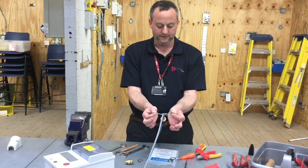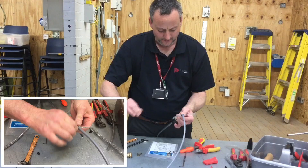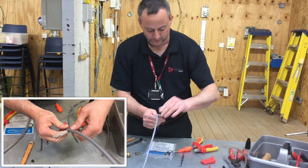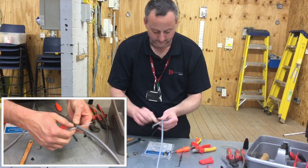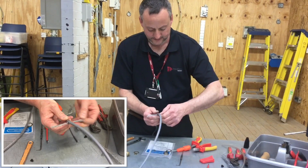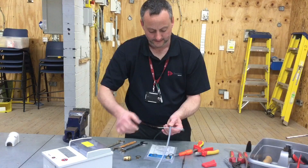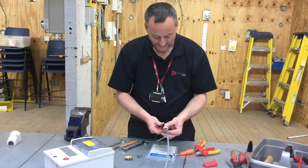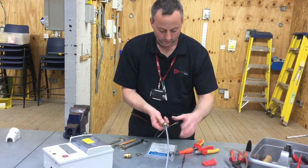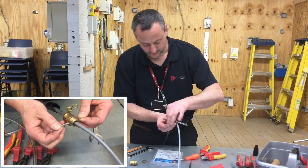We've got a nice 50-50 split. Strain it out. Some people say you can twist them at this stage, depending on the gland and the size of the slots within it — but we're just going to get them flat to start with. Once they're flat, turn them 90 degrees and flatten them out again. Bring up the gland, making sure we've got one of the washers in place, with the two slots lined up with the 50% split in the braid, and down we go into position.